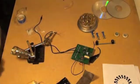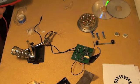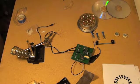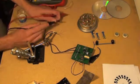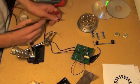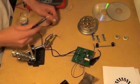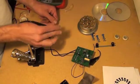Now that everything is tinned, we need to figure out which wire goes where. Unfortunately, not every headphone cord has the same color scheme, so we need to check using your voltmeter set to continuity mode which wire goes to which part of this connector. We want to start with the tip. This is called a TRRS connector, or tip ring ring sleeve. We have our meter set so that it beeps when there's continuity. We hold one lead to the tip and then find the other end to find out which color it is.